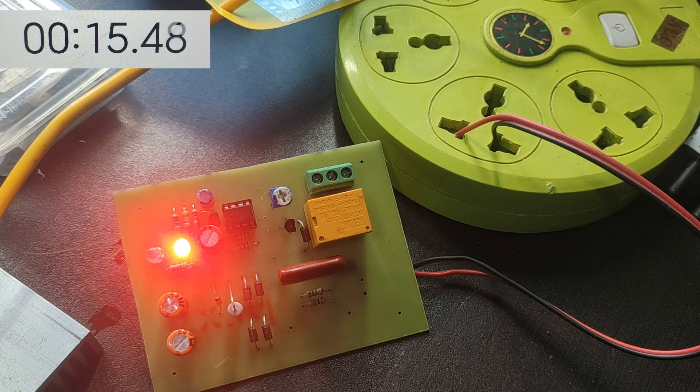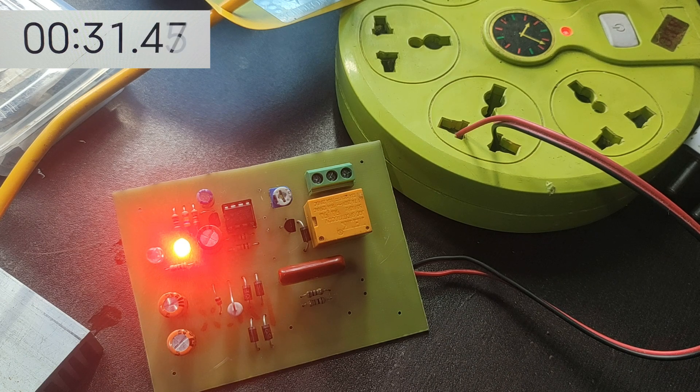You can also use this circuit for a power amplifier. This is a 555 IC-based delayed relay turn-on circuit. You can set the timer based on the resistors — I removed a 1k resistor from near the 20k pot and replaced it with a 470k resistor, so the delay time will be approximately one minute. You can change this circuit as per your requirement.